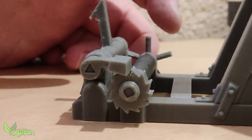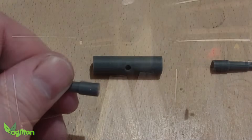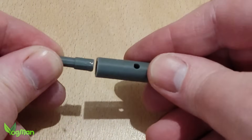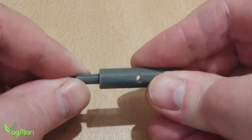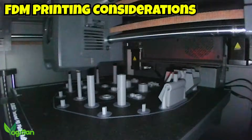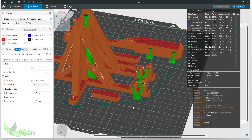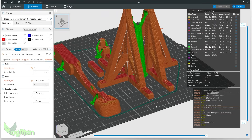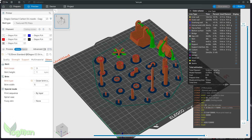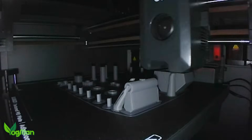As a whole, the process works, but it's more for show than true functionality. One final consideration: FDM doesn't lend itself well to precision printing. For this reason I've tried to incorporate small size differences wherever this occurs. If you have a problem, a little sanding may help. Alternatively, try printing the part at 99 or 98% scale. All parts should download already aligned to the way I printed them. There's a PDF instruction manual included — I recommended 50% fill for some parts with no brims needed, although tree supports can be useful here and there. Other parts are best printed at 100% infill with brims, especially where strength matters. Printing tall thin structures like these pins can sometimes cause parts to fall over and misprint. I've been using the Elegoo Centauri Carbon and genuinely I've had no such issues, but if you do find your parts falling over, try reducing the print speed.